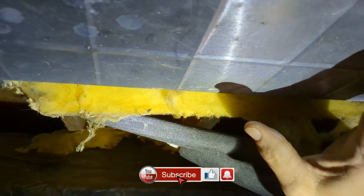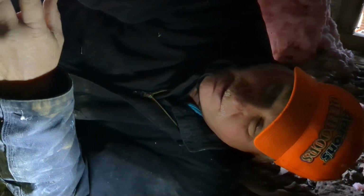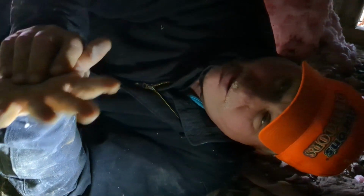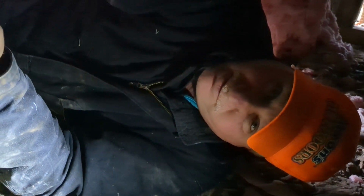It was intended not to have. Now, why would it have insulation over the top? If you have a difference in temperature from the inside and the outside of a piece of material, you'll have condensation. We don't want condensation up against the floor joist, and if it had a particle board, you'd probably learn real quick that it's not a good idea to have moisture building up against the floor, the particle board.